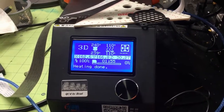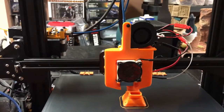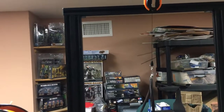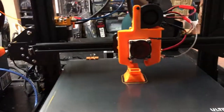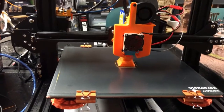That little fluctuation on the heat bed isn't bad — it's not 30 degrees of swing. The hot end is dialed in at 240, maybe drops to 239 once in a while — that's it. I'm impressed so far. There's no enclosure at all, but my attic doesn't have much temperature fluctuation — it's the warmest part of the house. I keep the vents closed up here and use fans. I'll be back — probably the last update unless something major happens. There'll be a time-lapse bonus at the end.